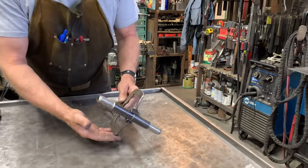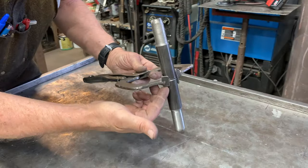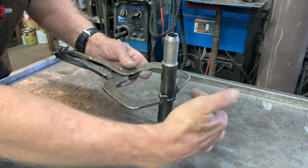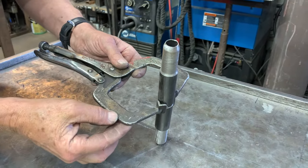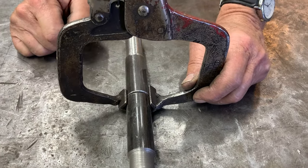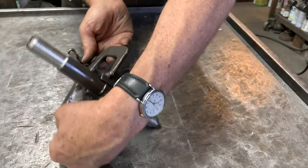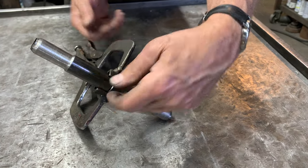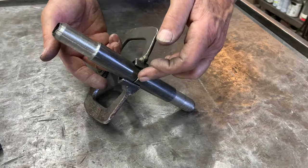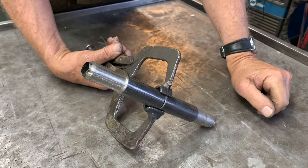This is another standard vice grip where I took some pieces of half-inch angle and welded them to it, so that when I've got to weld a cylinder to a cylinder, I can quickly clamp the two together, put a tack here, rotate it over, put a tack there, and then they're held together sufficiently where I can break the clamp off and continue the welding process.